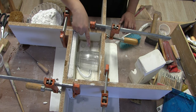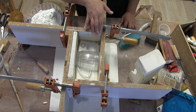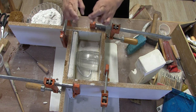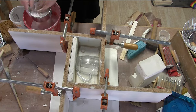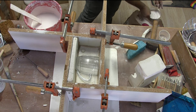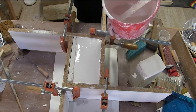I don't need too many of these mugs for the dragon — maybe four. The dragon is meant to be an intimate setting; I imagine only two or three people in it at a time to play games. I'm going to mix up some plaster and get it poured with my sifted plaster. I always tell my students that if you have a rainy day or damp weather and a lot of moisture in the air, you should throw in some extra plaster just to help with cure time. That's exactly what I'm going to do here — add in a bit extra.